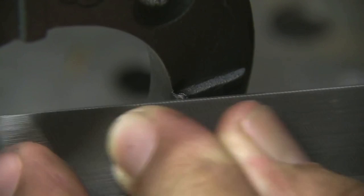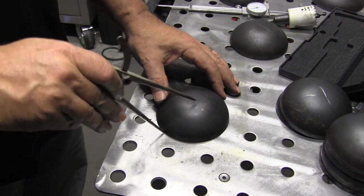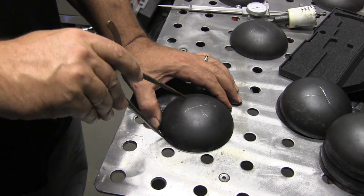Not all metals will do this — you can do this on mild steel and you can still file that — but if something's got a lot of carbon content like cast iron does, that'll give you a heads up on whether you're going to have trouble welding it or not. I'm going to do the same little test on a little threaded fitting here in a minute.